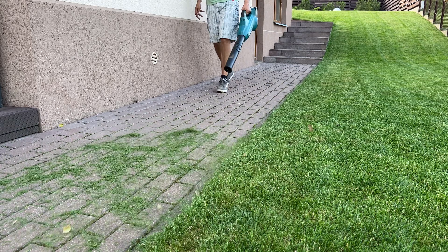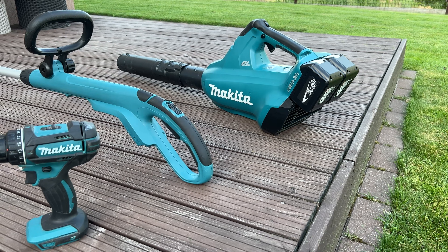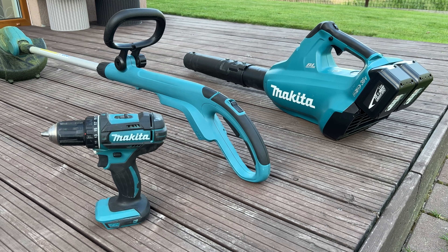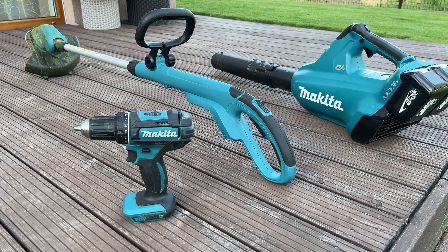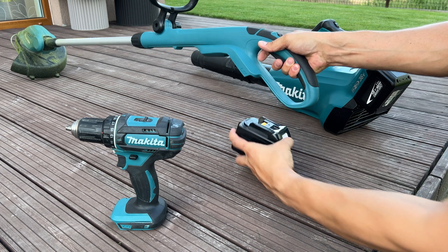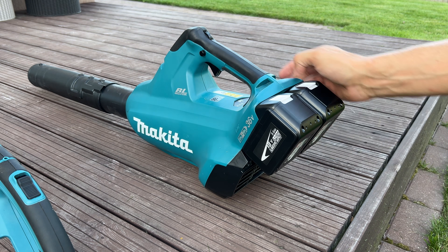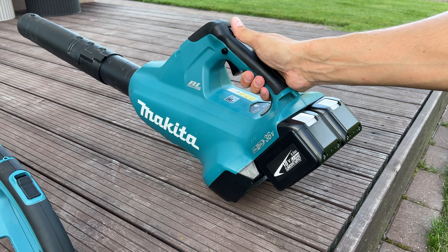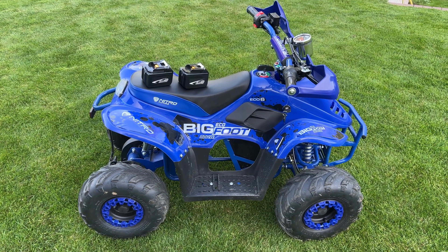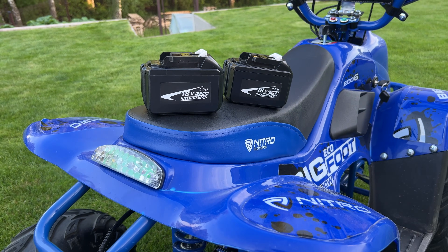These batteries are a bit heavier than regular up-to-5A Makita batteries, and potentially won't be the most comfortable option for daily use with a drill or other small tools. But my main purpose is to use them with high-power-demanding cordless tools like a grass trimmer or leaf blower, where weight isn't so important. Because I made two of those batteries, I can now power even 36V power tools like this leaf blower. And by connecting those two batteries in series, I could power any electric device driven by 36V motors — for example, a mini quad. But let's leave that build for another video. Thanks for watching, and till the next time. Bye.